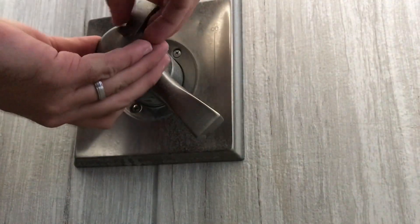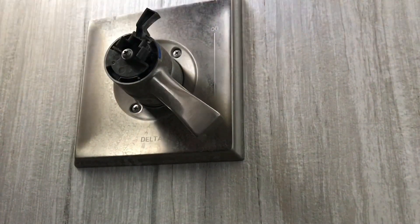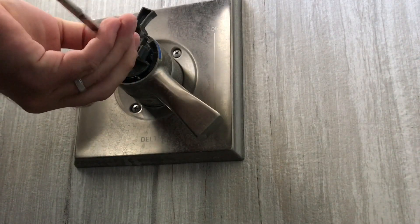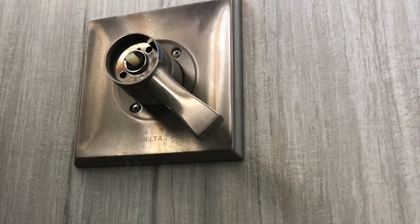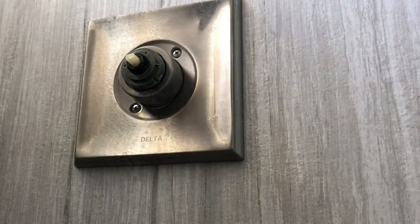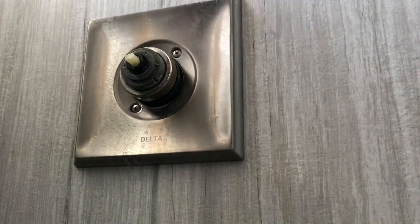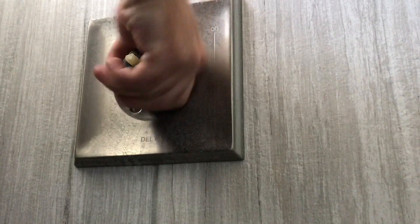All right, let's see if I can remember how to do this. First, take this little trim cover off — it just snaps on. Then we take this main center screw out. That lets your temperature controls come out, and then your handle comes off. There's a trim ring. There's a rubber O-ring in there that holds the trim ring on. You leave the O-ring on there because that's just on your brass body. There's this little ring here — threads off.